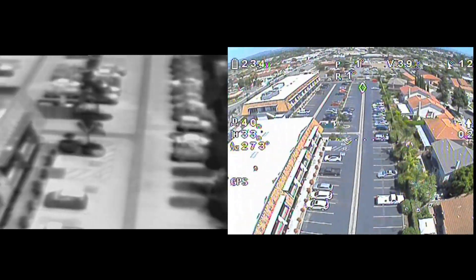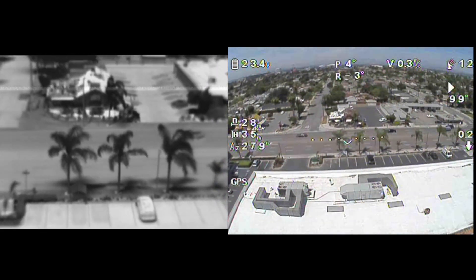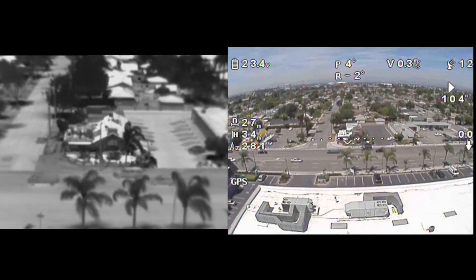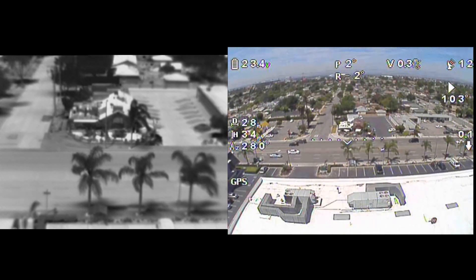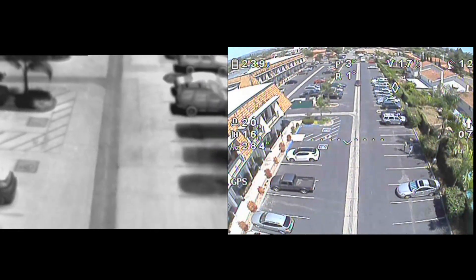The ICI 9320 has a radiometric sensor with a 320 pixel vertical resolution. The sensor detects long wave infrared light, which means it's truly heat sensitive and doesn't need any light source to pick up an image. It has a 7-14 micrometer spectral response and less than 30 millikelvin thermal sensitivity. This thing is seriously high tech in a very small package, weighing less than 50 grams.